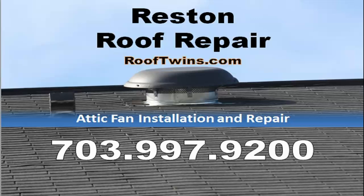The homeowner had mentioned that another roof repair company said you can't have an attic fan and a ridge vent together. That's partially true, but it's also incorrect. It depends on how close the attic fan is to the ridge vent. If the attic fan is within any distance closer than three feet, that's a problem — because all the hot air being pulled out of the attic will be thrown back into the ridge vent. You always have to make sure that the attic fan is at least a minimum of three feet away from the ridge vent. If it's any closer, that's a problem.